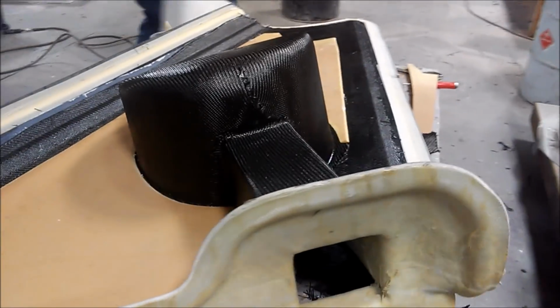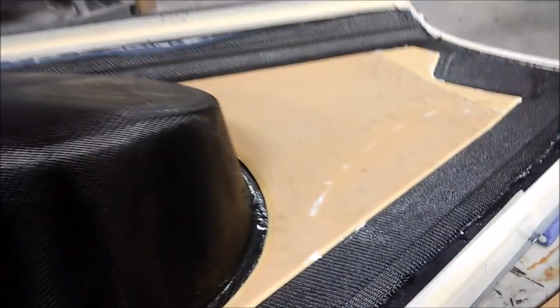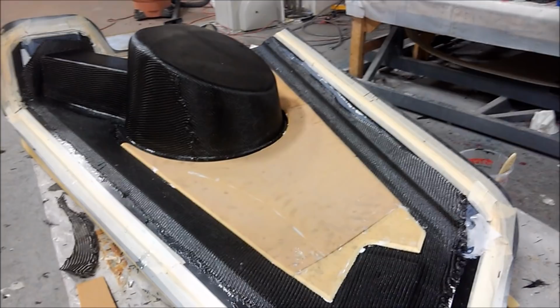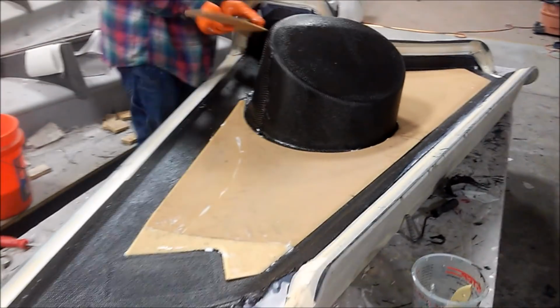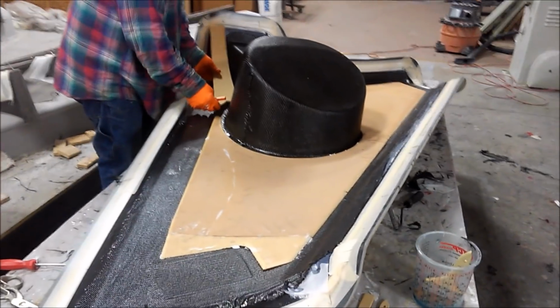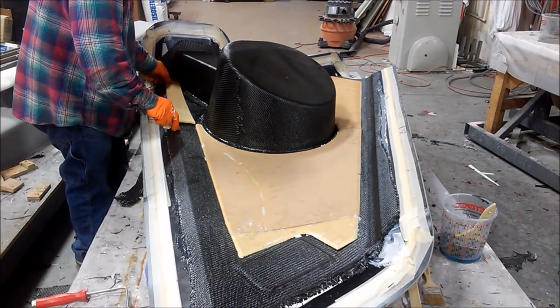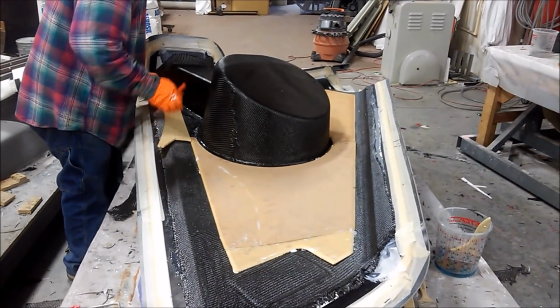And there won't be any core on the actual wheel well there. That just needs to have extra layers laid up because it's going to have the ribs butting up against that, which is going to add extra rigidity. And just the fact that it's sort of cylindrical shape there, it kind of strengthens up the whole wing as well. And the very top surface of it there actually mates with the top surface of the Strake there, so it just even adds more structural stability.